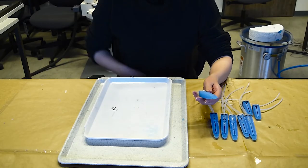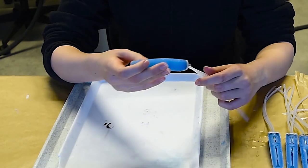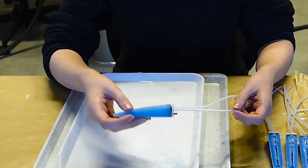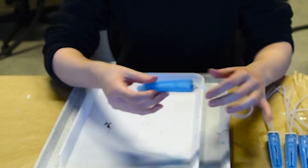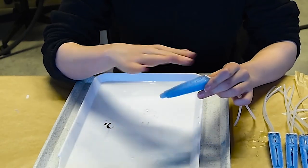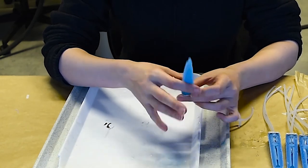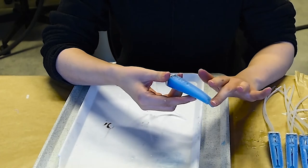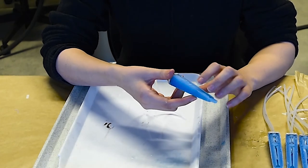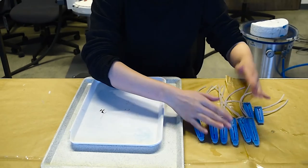After tubing the fingers, we attach the passive layer. The Silpoxie must be dried overnight; otherwise the new silicone might not cure correctly. The passive layer is added so that when the fingers are inflated, the finger bends in one direction, as the layer is not elastic. It's important to check that the tubes are not clogged before adding the passive layer, as this cannot be corrected after this step — throw some air through the tubes to test.